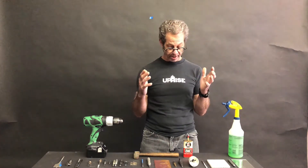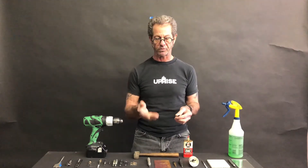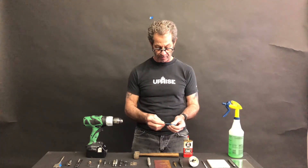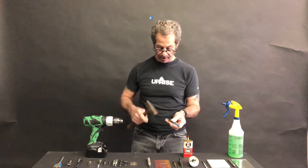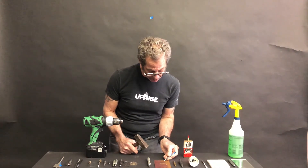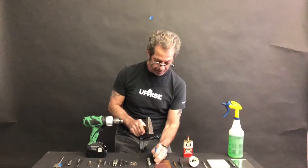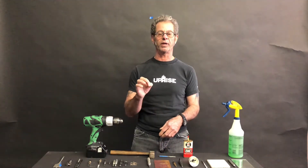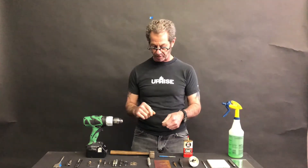I also talked about center punches. Center punches come in a range of different sizes. This particular center punch is used with a hammer — typically you make a mark on your material, bring your center punch alongside it so you have a clear view of that mark, raise it up into position, and that creates a dimple in the material that helps the drill bit find exactly where you want it to go and minimizes wandering or scrolling on the surface.